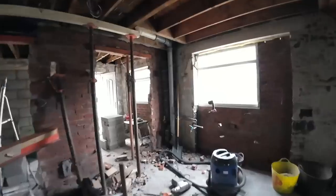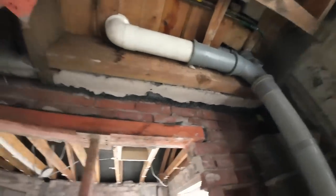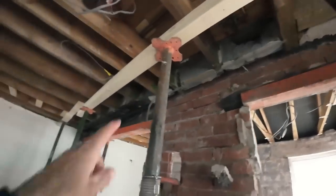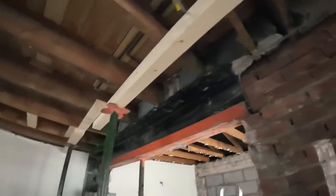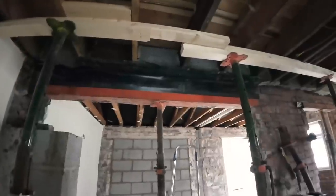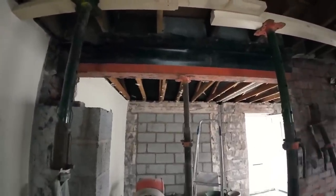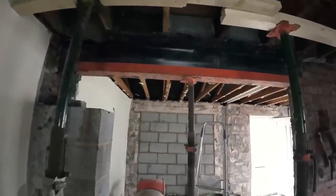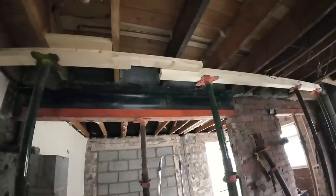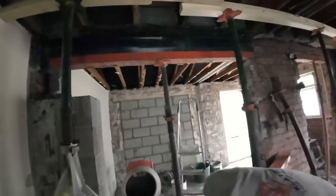And we've got all the block work staying in beautifully at the moment. Not budging. And then we put our strip on those three. They're not going anywhere. And then this one's got this cavity tray nailed to the joists when they installed it. So they put an absolutely pointless cavity tray in there, because the cavity tray needs to go above the roof, above the lead flashing, not down there. If there's no flashing above that cavity tray, it comes down to this one, hits this one and just exits into the room. So there you go.